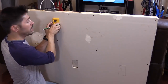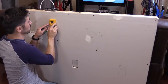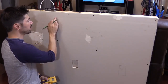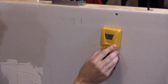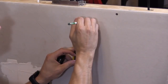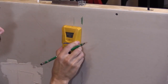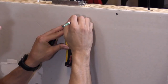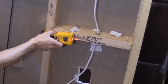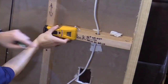You mark that edge, then go to the other side, hold it, and slide it over — mark that too. So you know there's a stud: this is the left side, this is the right side. Always double-check your work and there's your stud. The electronic stud finder also works for fire blocks. You scan on the other side as well and then you know where the fire block is in the wall.